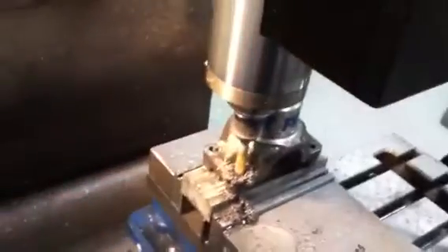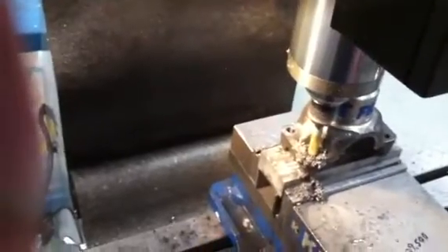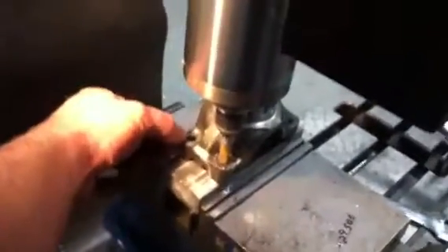The center distance between the threaded holes and the U-bolt are different, so we have to use an end mill instead of a drill. A drill would just follow the path of the old hole, but an end mill is independent of that — you can push it through any material. We're first plunging through to remove the old thread, then interpolating an arc to give a nice flat spot for a nut to sit on the back side of the U-bolt.